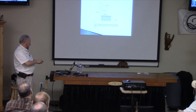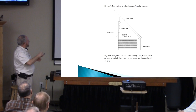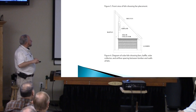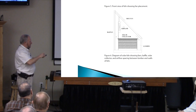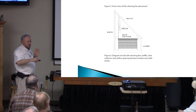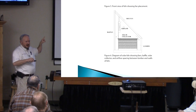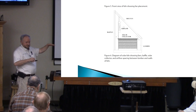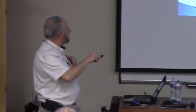This is the stack of wood. In my case it's a tad over 36 inches wide, about 40 inches, but figuring in the separation between the boards I'm going with three feet wide. The kiln is 14 feet long so I can use 12-foot lumber. I have to keep a foot of separation all the way around on the sides and ends for good airflow around the stack. So my stack is 36 inches wide and I can go up to 36 inches high. That gives 19 rows of wood with stickers, which is right at 700 board feet.